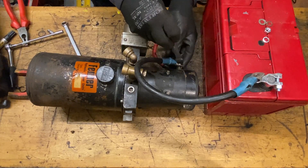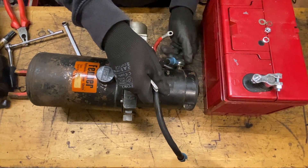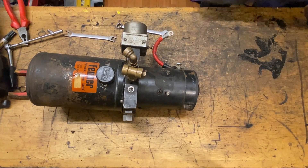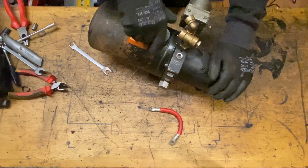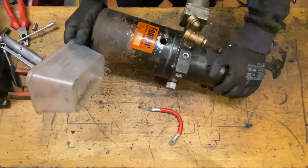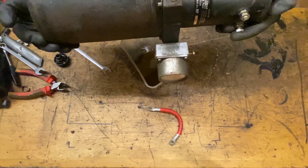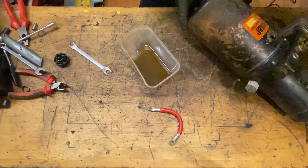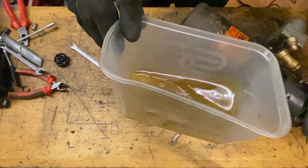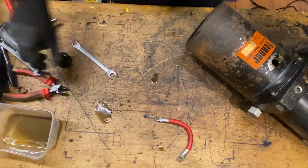Get this battery out of the way. Let's have a quick look inside and see if it does have any fluid in it before I take the tank off and make a mess everywhere. I'm just using my little retaining bucket — turn it upside down. Oh look at that. It kind of looks like the fat they use in KFC chicken gravy. There's all kinds of mayonnaise and gunk in there. It looks horrendous. That does not look pretty. So that might be the reason why she's not working too well. Let's get that tank off.